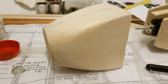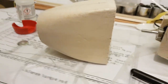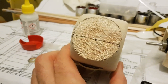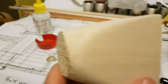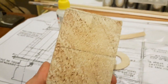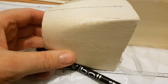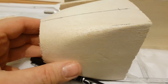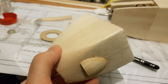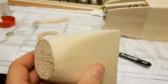What I've made is this big plug, and what I'm hoping to do is to mould a plastic bottle over it and maybe use a plastic bottle. I've just stuck on half a wooden spoon to give me a bit of an air scoop — that's two inches diameter, about the same as a spinner. So I've turned an oblong into a round, and it doesn't look too bad. I'm hoping I can mould something there, like I did with the cockpit that time. I've got no idea how it's going to go, but we're going to give it a go. If that fails, I can cover it in fibreglass or take a mould off it and make a fibreglass one.